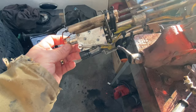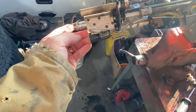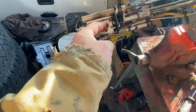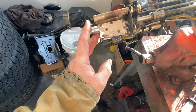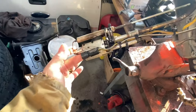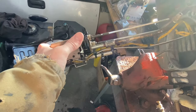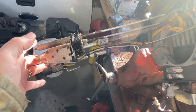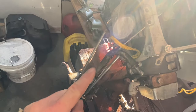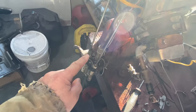I have another head I'm going to put in, but for now and for test purposes this is what we have. This unit right here is the CK Burners block that you buy - others have made their own or other companies sell it. The heating element comes in the back side here, and the thermocoupler comes in right here to sense the temperature. This is actually where the mixing occurs between here and the nozzle head, and then it sprays. This top pipe coming in is where your air pressure is coming to the nozzle. Down in there is actually the original Beckett unit - this is where the oil would have come in under pressure with no air assist.